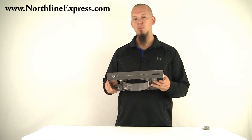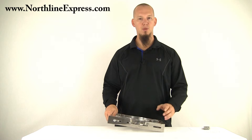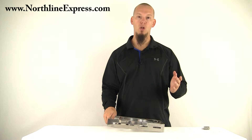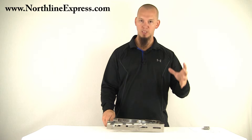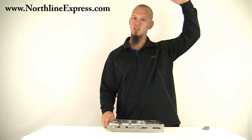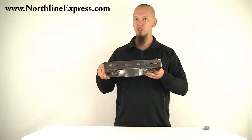You need a wall bracket every 10 foot of vertical run on the chimney pipe, so they're typically used in a through the wall installation. You run off your chimney — say off your wood stove — through the wall, into a T-support. From that T-support, every 10 feet of vertical run, you need to have one of these installed to support the chimney from moving.